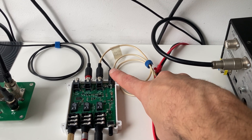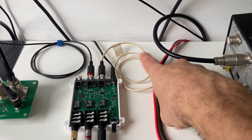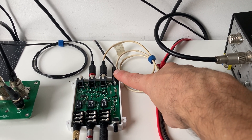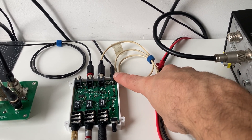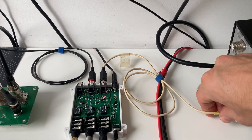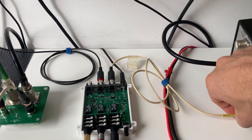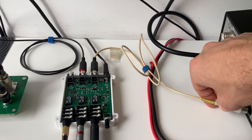That's why it's important for your audio switch and transceiver to have a common ground through the power supply. When you connect your audio switch, you have to make sure the grounds are common. I'm using the same power supply, so of course I have a common ground. If you don't have a common ground, your switch will always be in transmit mode. Okay, let me plug the cable back.